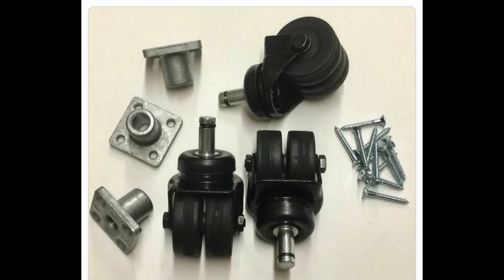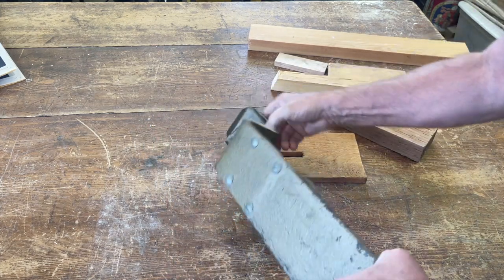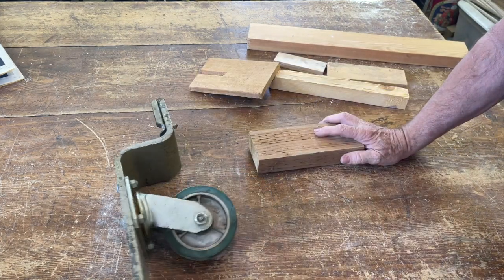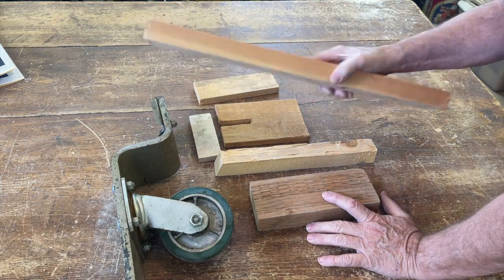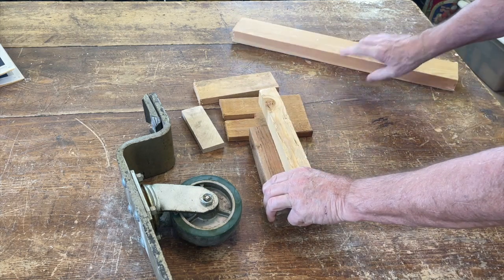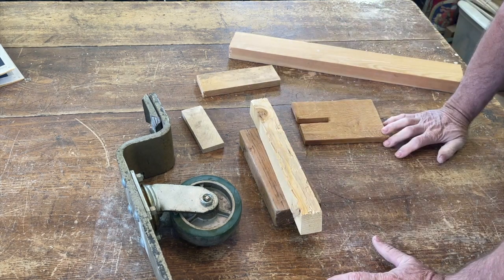One thing I like to do when working with a spider dolly is get a board and cut a notch in it like this, so it can slip in as you're putting the dolly on — it supports it really well. Also, get several blocks of wood in different sizes. I always carry two boards about two and a half feet long. If you need to pry something up you can lift it this way, or higher this way — just a little bit of leverage is usually all you need when working by yourself. You can pry it up a little bit, slip your pieces of wood in wherever needed, so just carry a supply of wood.